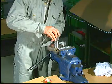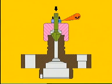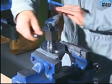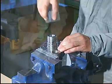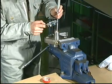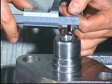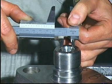Use the milling tool if more serious damage has occurred on the seating surface for the fuel oil high pressure pipe. Loosen the screw and press the spindle and stop ring downwards. Then retighten the screw. The diameter of the seating surface must not exceed the value stated in procedure 909/6 in volume 2 of the instruction book.